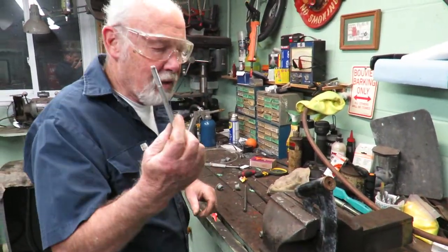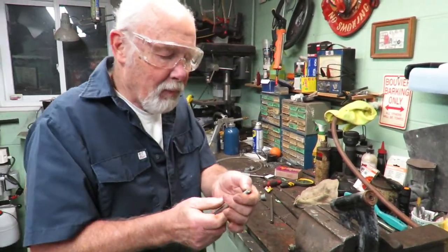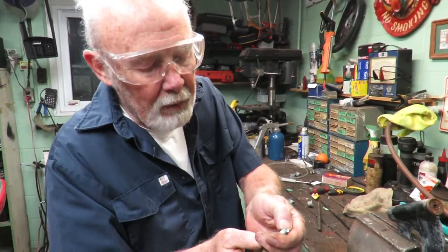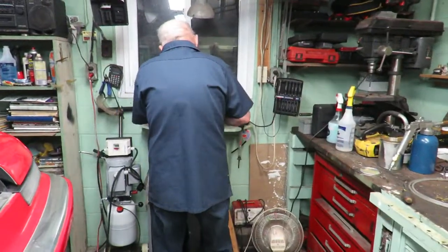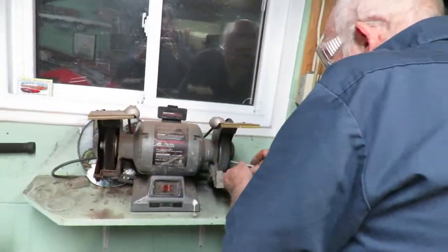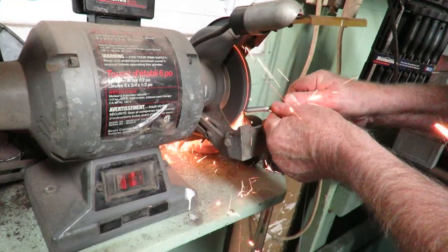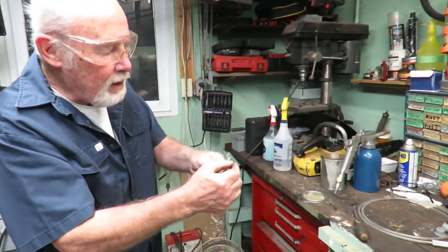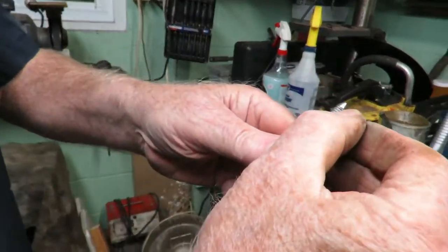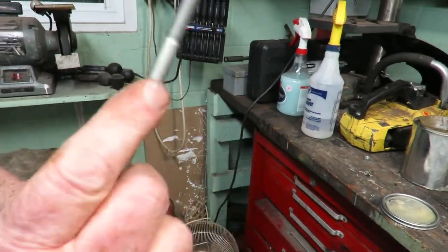But before that, this is the bolt that goes through it. Every single one of these when I bring it in, I do a little something special on the grinder. I put a bevel on it and then I put a groove on it. The groove acts like a thread starter and it really saves you a lot of time. I do this on every one.